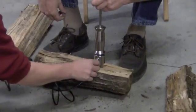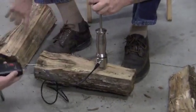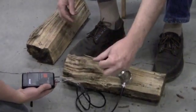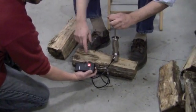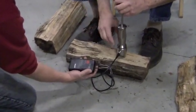This is maple that was cut this year. What we're doing is taking two moisture readings in the middle and one on either end, then averaging them. It's not precise but it's pretty close. The moisture meter can be set to the species of wood, so this one we're getting 37 percent on this reading.